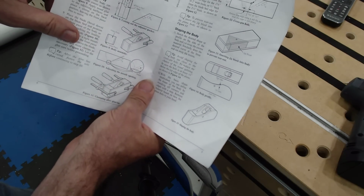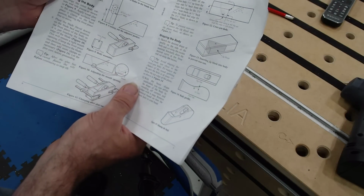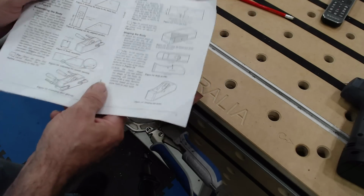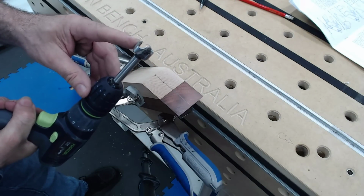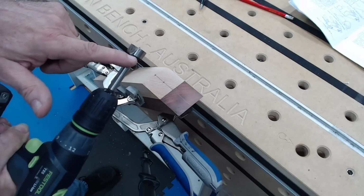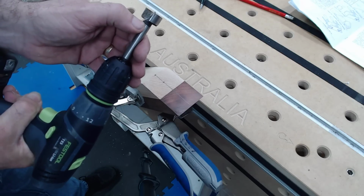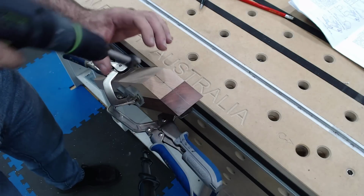At the A mark, which is this one here, drill a 7/8 of an inch hole to the depth of 5/8 of an inch. Right. I have a 7/8 Forstner bit. The depth from the tip of the cutter to the back is 1/2 inch. So I've come to almost all of the way past the black section there. So we'll do that first.